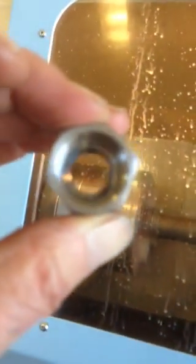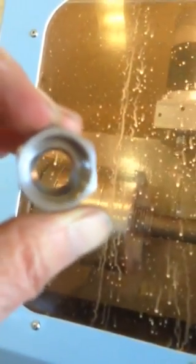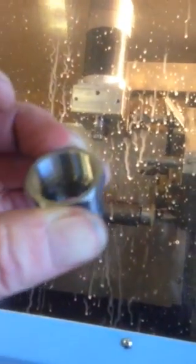Now we're turning the OD of the hex, turning the diameter behind the hex. This is the part here — there's the hex, and then down in here, I don't know if you can see it, but there is the milled-out area where the collet hooks in. And there, of course, the thread. There's a nice finish — it's really a good-looking part.